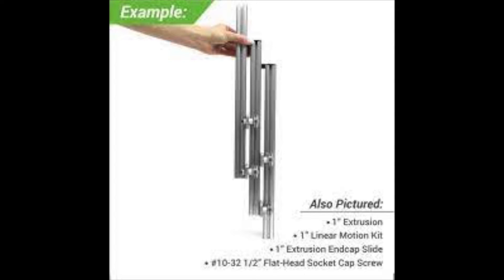The second type of mechanism that increases the reach of the robot are linear extenders. These can be used in almost every game, similar to arms, and they convert rotational motion of the motor to linear motion, either vertically or horizontally. They allow you to reach game elements you can't otherwise reach, pick up a game element at ground level and raise it to deposit at a higher level, or perform other tasks at height. These linear extenders are usually made up of different pieces that slide parallel to each other to create linear motion.